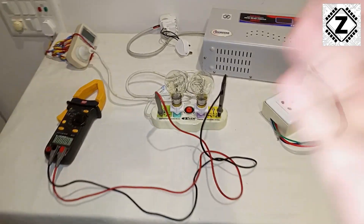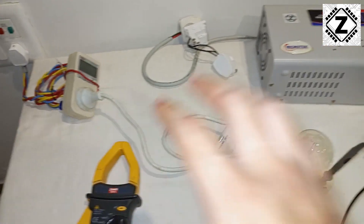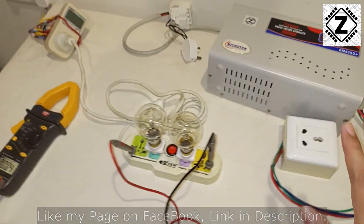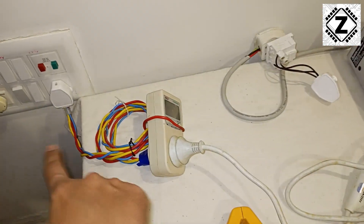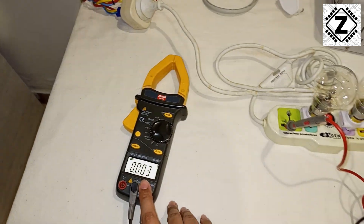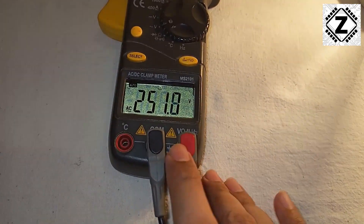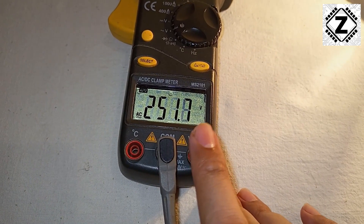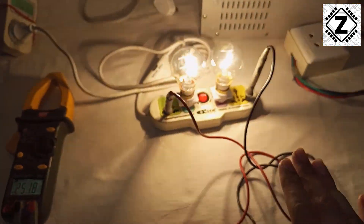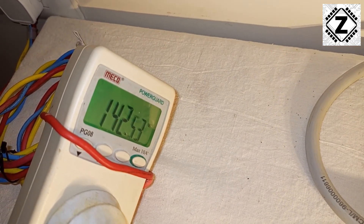For load testing today I brought out these incandescent bulbs — they are 60 watts each. We're going to first measure them raw, without the stabilizer connected. The stabilizer is completely disconnected and isolated, so power flows from the source into the power meter and then into the two bulbs. I also have a voltmeter connected to check the supply voltage. Let's turn it on. The voltage is 250 volts and the power consumption is 142 watts.